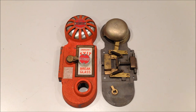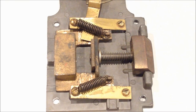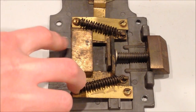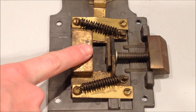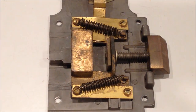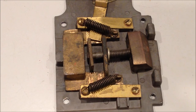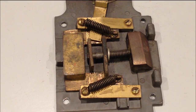These are two halves of incomplete units that I'm going to use to show you the inner workings of the device - how all of this actually works when the device is activated. This is the unlocked or activated position. To reset it, you push forward this bar, the springs pull against it, and it latches into place. Then when this is pushed down by the strike handle, it activates - the springs pull it back into position and the bell activates. Don't ever do this if you come across one of these, because you could really easily get your finger caught in there. But that's how it is activated by the strike handle.